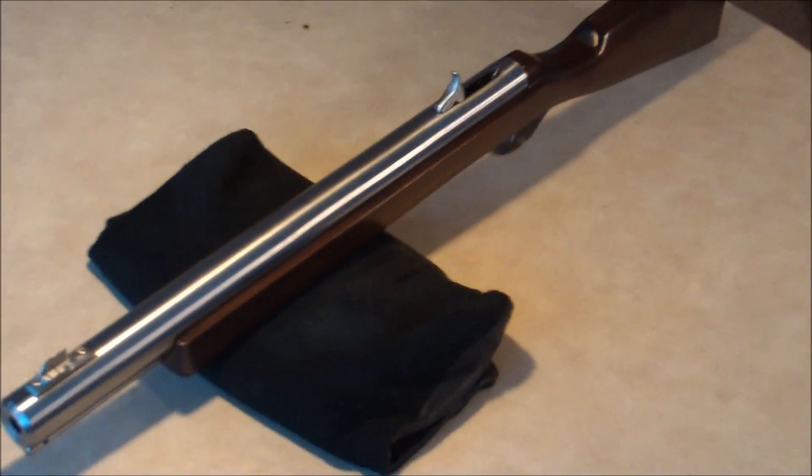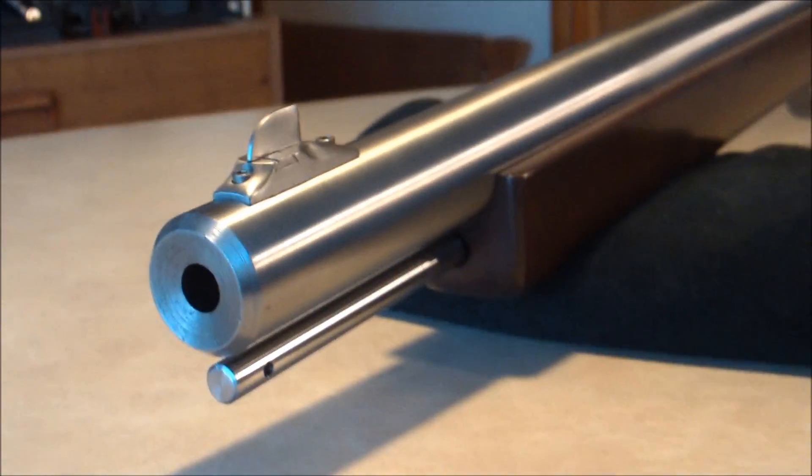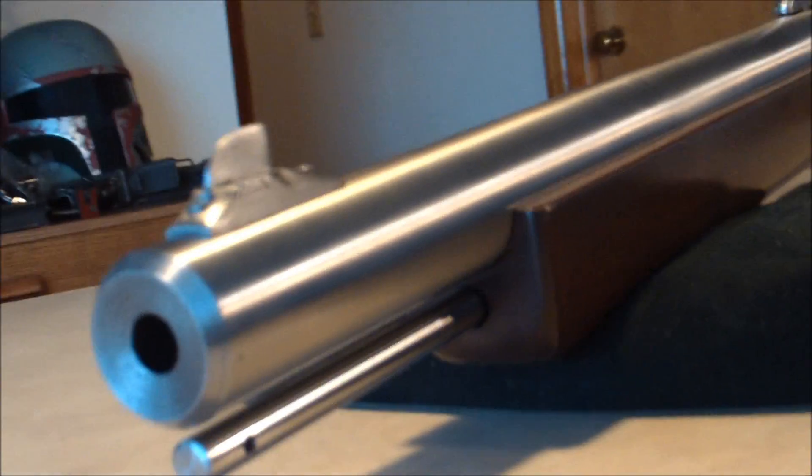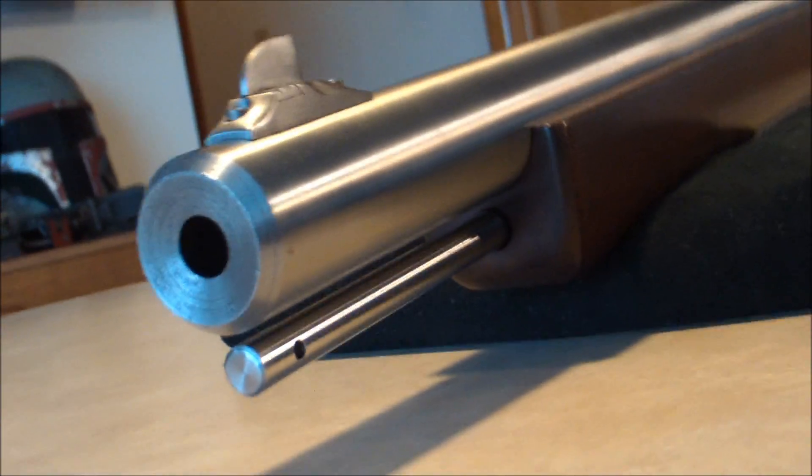Here's a quick look at my musketoon. Except for the pins, the springs, and the screws, everything is handmade. The barrel is inch and a half round stock steel with a 50 caliber smoothbore drilled down 17 inches.